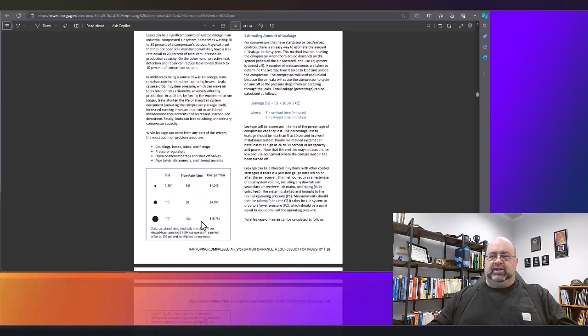And then I'll show you a quick leak table that you can obtain right from the DOE as well. And these links are going to be in the description. So this one here is on page 28 of this manual. It basically says we'll take a small, like a 1/16 of an inch leak. Flow rate is 6.5 cubic feet per minute. And the cost per year comes out to be about $1,046, assuming 10 cents per kilowatt hour and round the clock. Most of the tables are based upon 8760 hours, which is 24/7.